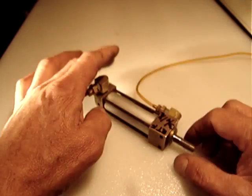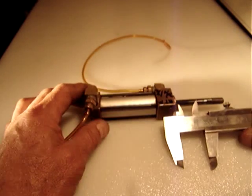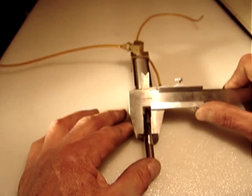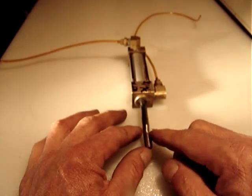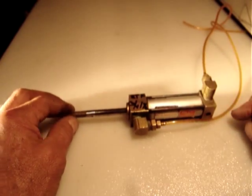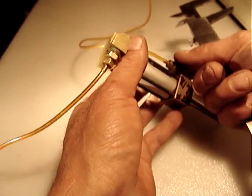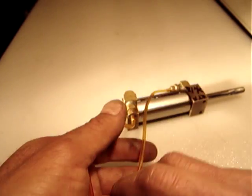It's a one-inch cylinder. I measured it and it came out to about one inch and three-eighths in length. The piston diameter is 5/16. The threading is 18 threads per inch, standard. The dimension of the cylinder body is one inch square.